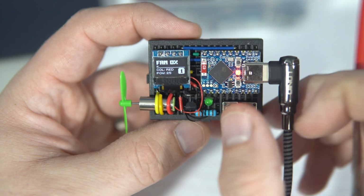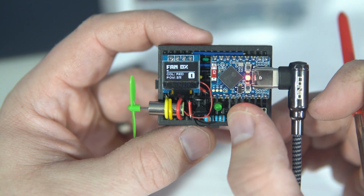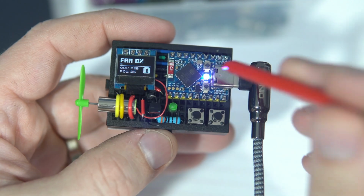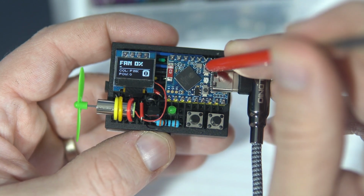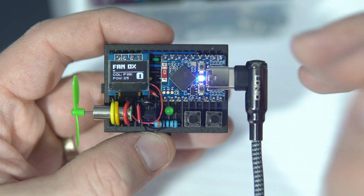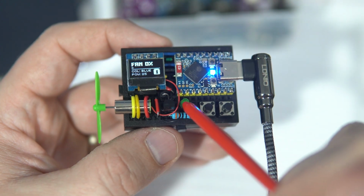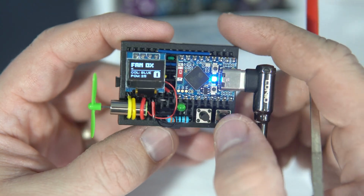And with this button I can change color of this built-in RGB. Every change is visible on this screen. And yes, I can also change brightness of this LED, because here we have boot button or pin 0. With that button I can change brightness. So 3 push buttons are used here, and motor and OLED. And this LED is dead. Not that I forgot to do something with it, but it looks good on this black breadboard.